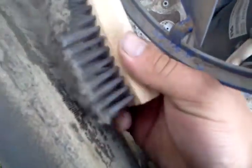So I'm doing a pretty decent technique. This is just a wire brush. It's a welding brush, off one of them little setups. The bristles are pretty new and straight on it, so it works pretty nice. You can just brush it through the fins. Just go straight up and down. It doesn't bend the fins, it mostly loosens it up and you can blow it out. That stuff's just caked in there. But now look at it, it's all gone.